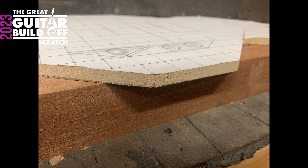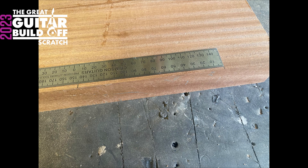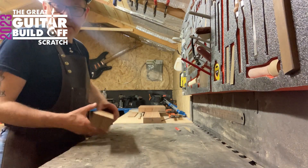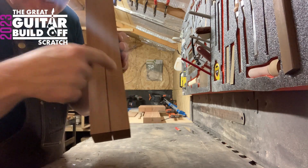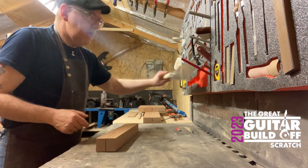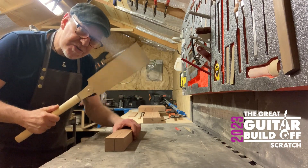Just a close-up there of the overhang on the wood so you can see what I need to cut. You can just see it overhanging on both sides. All you need to do is measure where the wings go and cut it out — simple as. I've just been on the bandsaw and I've put a line up the center here. I'm going to cut across here to get my two little wings, and for that I'm going to use the pull saw because it's awesome.